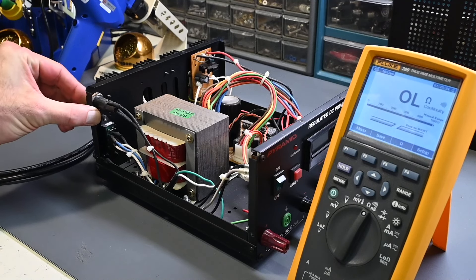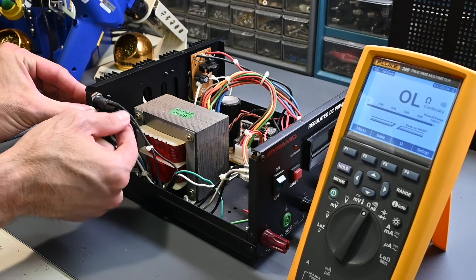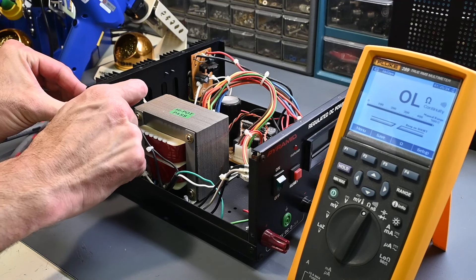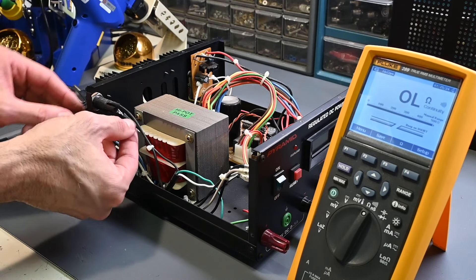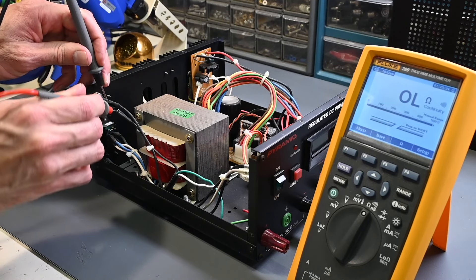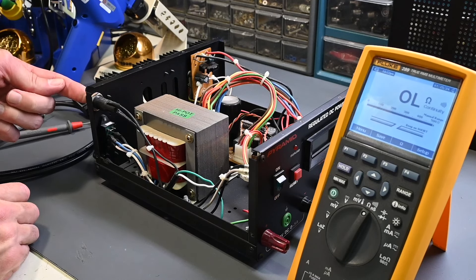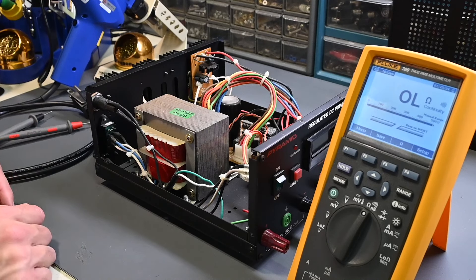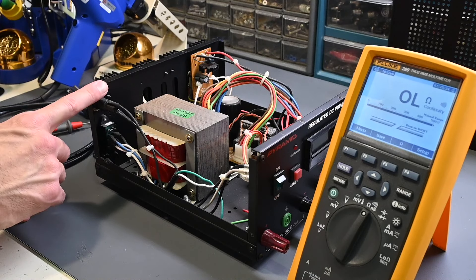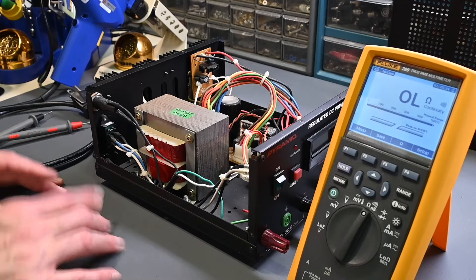It's got spring tension on it and it feels tight. Wires are soldered on there, that looks perfectly fine. Even if there were a bad solder joint, I'm touching right on those tabs — it's not anything past the fuse holder. So it looks like the first thing is to get that fuse holder replaced. It's an odd style with a square cap, but it's a normal panel mount fuse holder. I should be able to replace it with a more traditional type with a push-in, twist-and-lock cap. I'll get this fuse holder replaced and see what happens.